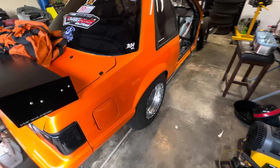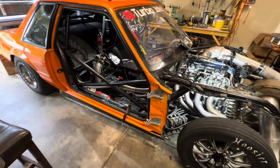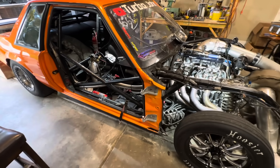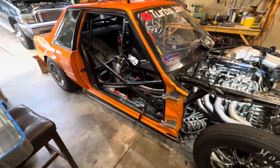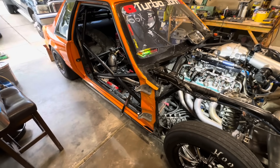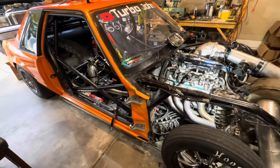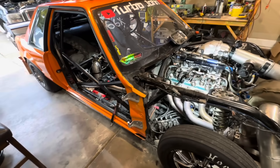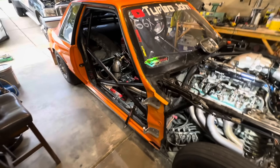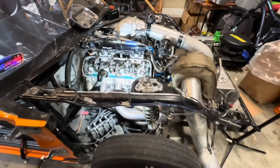We're going to Rico on Sunday - King of Rico. It's pretty smooth but it's an older track. The first 330 feet they've ground but the back side they have not, so it's not perfectly smooth - we've got to be able to get across it without chirping the tires. Galot is also running on Saturday with about a $100 entry and $2,000 on top - it's a top-tier facility, butter smooth out there. We may take it Saturday too just to see how the rear is separating, because if I move it up a hole it may not have enough leverage to separate and we don't want that either. These things are finicky.